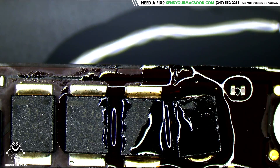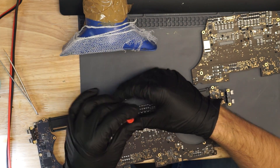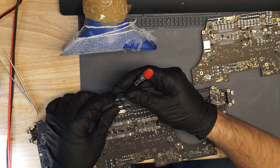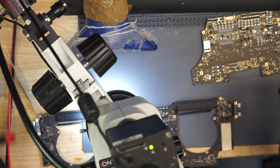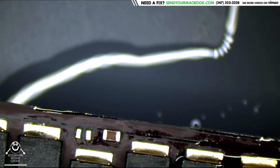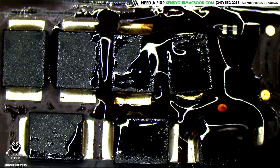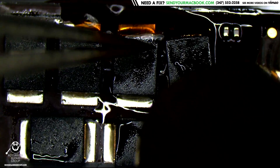If you're truly triggered by the placement, you could just use hot air to flow it into place. I'm going to remove that display cable before I burn it and flow it into place with the hot air station. The hot tweezers Jesse uses are really good but just not for a cap that large. For stuff like this it really is handy to do it with a soldering iron — you don't disturb the surrounding components with heat.